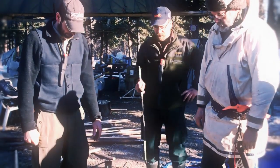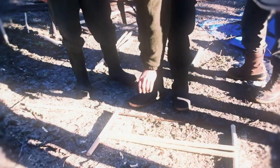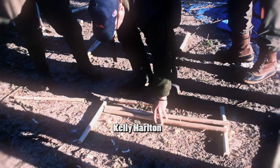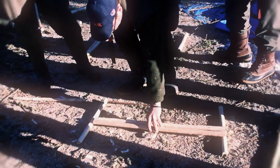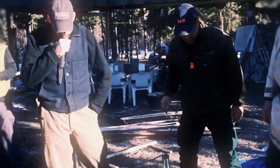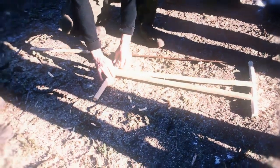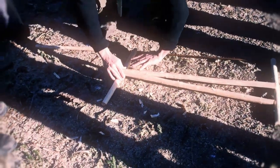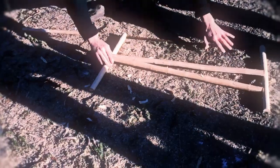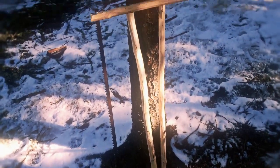One of the sticky little advantages I found with the V — that's my idea, by the way; I'm the inventor of the V — is that if you want lots of tension on your blade and you're cutting smaller stuff, you can slide this down here and retighten your frame. If you're cutting big logs, simply loosen your frame and slide it up here. You might as well make the V the whole length of your uprights so you can easily adjust. Keep the bottom brace parallel — that enables you to cut through a large-size tree.